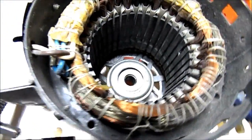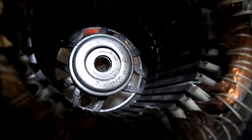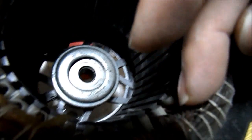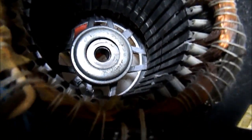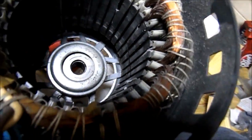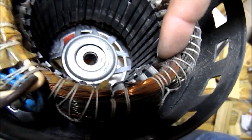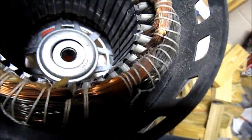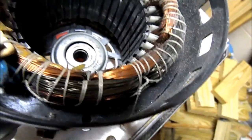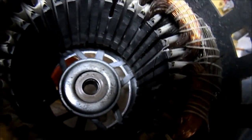That's going to be quite a bit of work pulling them out. I did end up breaking a couple of strands. Now I have successfully soldered these wires back together. The problem is you have to be really careful — you can't solder the wires where it's going to touch any metal. You pretty much have to seal the wires so that the electricity doesn't arc over to the metal. But it can be done and I have done it.